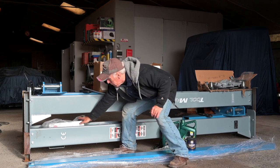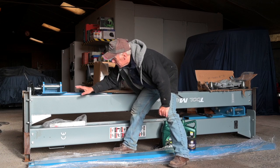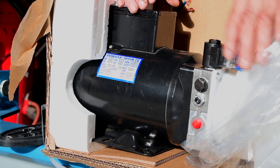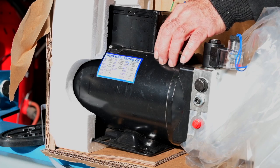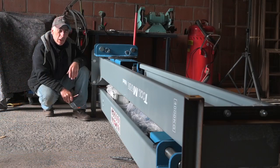The control box is also inside one of the pillars. And here you have the hydraulic motor, the motor and the hydraulic pump and the reservoir. If you order the lift, make sure that you specify the motor for the right voltage — so if you have 220 volts monophase, specify it. If you're planning to install the lift yourself, then be aware that the weight is quite heavy.